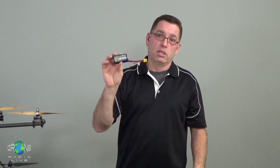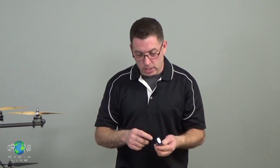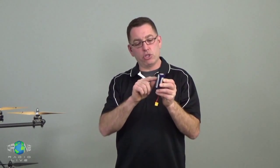These batteries are very dangerous, and if we're going to talk about basics of multi-rotor helicopters, you should know right off the bat, these batteries are dangerous. Okay, you shouldn't keep stacks of these things fully charged in your house. After you're done flying and they're discharged a pretty good amount, just leave them like that. They're better off that way anyway. They last longer. But if they come back damaged, if you wiped out and the corner of the pack is damaged, or it's perforated, or they're really heavily puffed and they get hot when you use them, stop using them. Damaged cells, puffed cells are a fire hazard. Don't put them in your house, and always charge on a hard surface. Always charge where there's access to a door or a window.